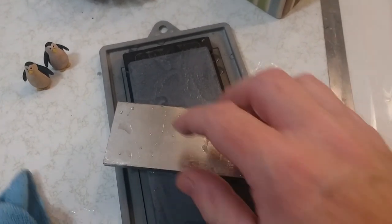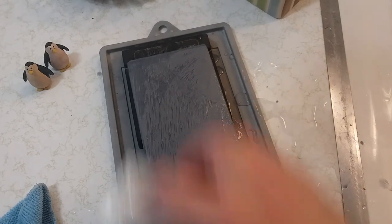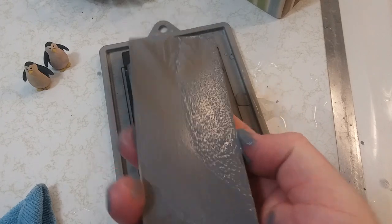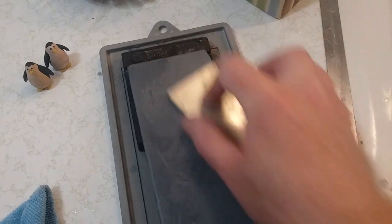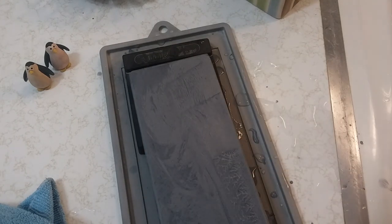Okay, I'm back. As you can see, I've taken my 80 grit diamond plate to it. I've rounded off all the corners. And I got to do this with both stones. This is the 600 grit well-worn diamond plate that I used to flatten my stones. I used the 80 grit first, and I go over it with this to smooth out the stones and make sure they're dead flat. You draw a grid or an X and lines or whatever, and then after the fact, you take a well-worn diamond plate, or you can use wet dry sandpaper that you can get at Walmart, all kinds of stuff.